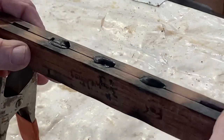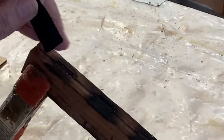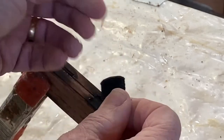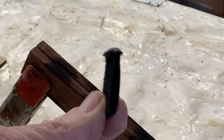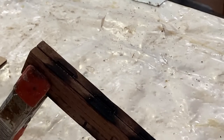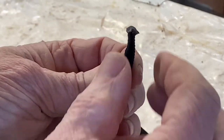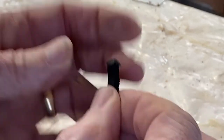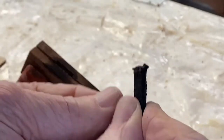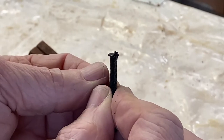Once they've cooled enough, you can remove them from the jig and you'll want to break off the feathered edges. If properly melted, they're going to have a bulbous mushroom-shaped cap. This one looks good. Here you can see an improperly melted cap — it's very small, very thin, and under a lot of stress could actually pull through or break off in the slot in the deck.